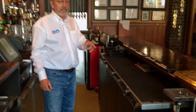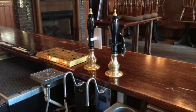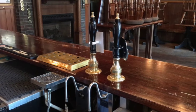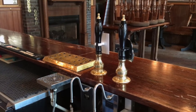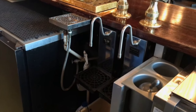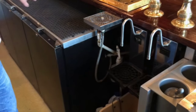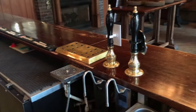The keg cooler here is basically a three-keg cooler. We serve two cask ales at all times and often have the third one ready to go. These beer engines are actually water-jacketed beer engines, so there is a jacket around the cylinder that you can run coolant around. We have a water reservoir — basically a bucket of water with an external pump — that pumps the water up the beer line, although it's only about three feet, around the water jackets and then back into the bucket.